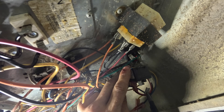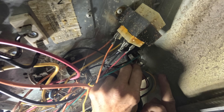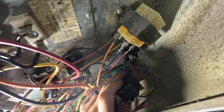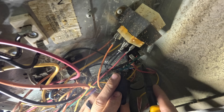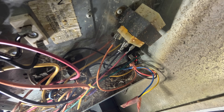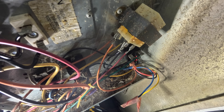All right, this little blue wire comes over from the heat strips. That's normally closed and that goes to low speed, and this one has power all the time. That's normally open — it goes to high speed. First let's just see if the fan comes on. It does.